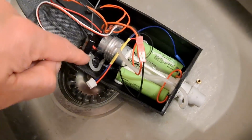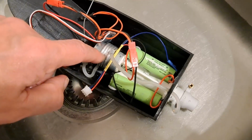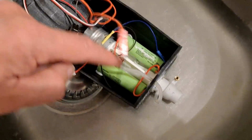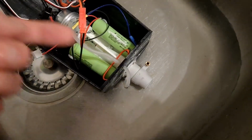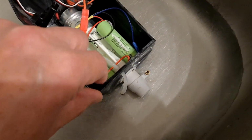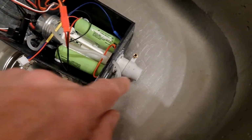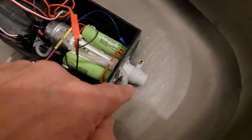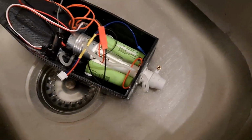That's sealed into the bottom of the boat. Pipe goes onto that, round the motor, out the back there, and because the water's shooting out on the jet, that encourages, I don't want to use the word suck because that isn't quite right. It reduces the pressure there, so you've got increased pressure there, reduced pressure there, so the water is siphoned through.